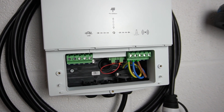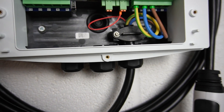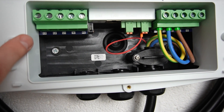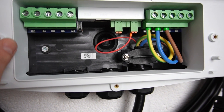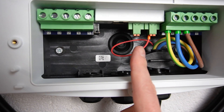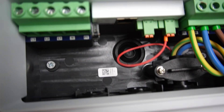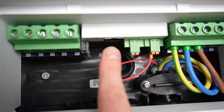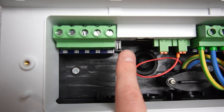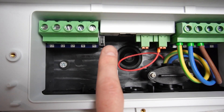Now I just have to wait for my installer to do the electrics. While I've got it on the wall, I may as well show you what's inside this little box underneath where the wiring goes in. The installer is going to pass all the electrical cables through that central grommet there and it'll pop up into this little void, with all the connections made on the various ports for the different cables. One of these is where you put the CT clamp that monitors the grid import and export, which will be important for knowing when there's excess solar that can be diverted. There's also a LAN connection socket here if you want a hardwired internet connection — I don't think I'll need that, the Wi-Fi signal is strong enough. And there's also a SIM card slot for a 4G SIM card, so if you were without Wi-Fi you could set that up with a 4G connection. I actually didn't know it had that — that's really neat.